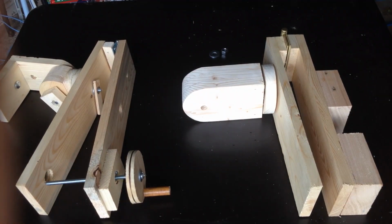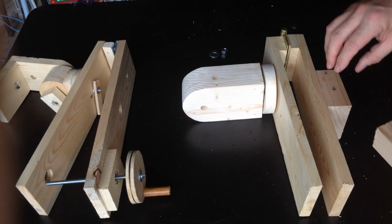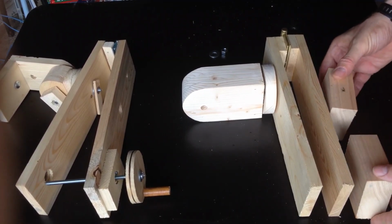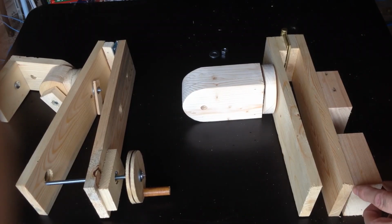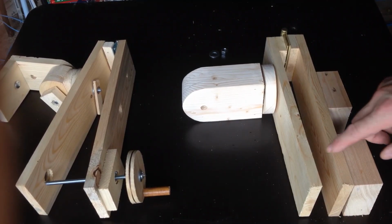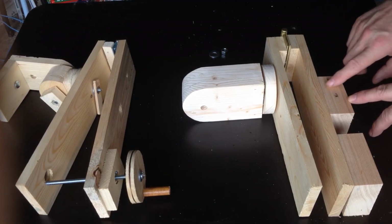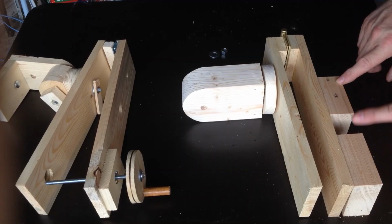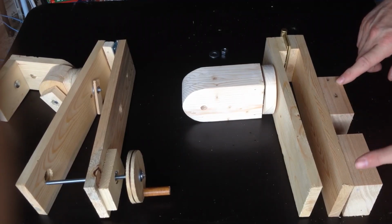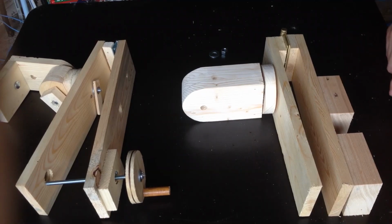While the glue is drying on the header piece, I went and cut two pieces of 2x4. They're not quite 2x4, but the pieces of one. Rather than glue 2 or 3 block pieces together to get that thickness, I just added this. This will add stability for the rod going up and down. This will have two purposes. One will be the bolt that holds it onto the tripod, and the second will be for a 3/8-24. So I'll have a 1/4-20 and a 3/8-24, and I'll compare how stable the 1/4-20 is and the 3/8-24 is. I'm not sure how that'll work, but it's a good experiment.